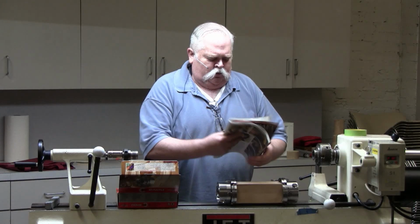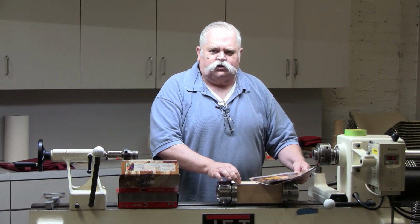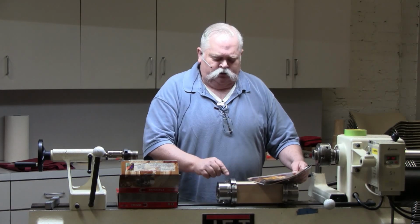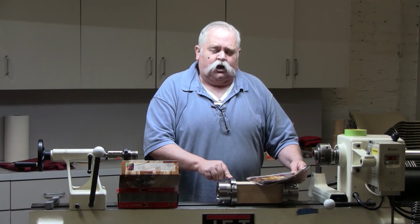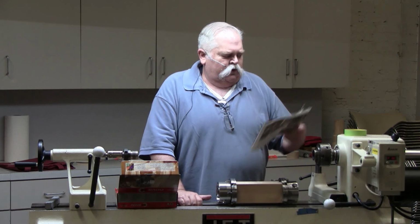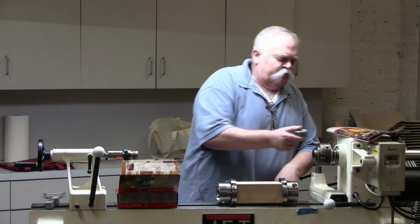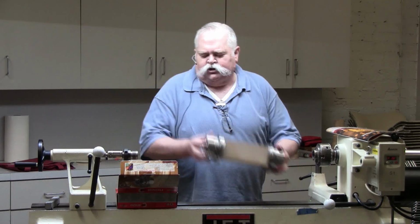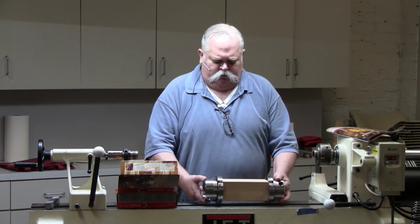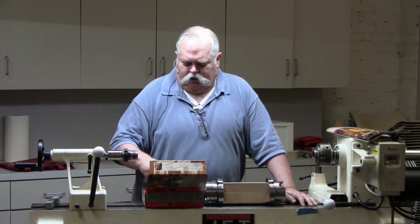What I wanted to make was this tree, Christmas tree. And you have to have 4 pieces, exactly 1.5 inches. The 100 millimeter jaw set will accept 3 1/8 inches of wood. So you end up with an extra 1/16 inch with the 100 millimeter set. And you put your normal adapter on, and then both of these adapters screw into your chuck. And I took it up today to about 1600 RPM. I didn't have any vibration. I didn't have any noise.